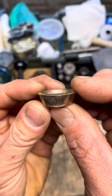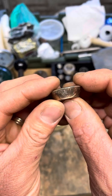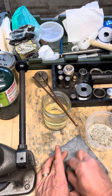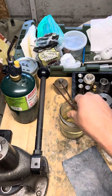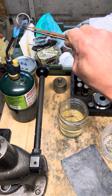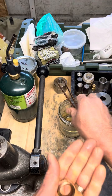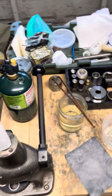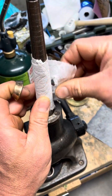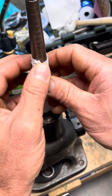Let's take a look and see what we got — nice and straight edges. We can go ahead and sand the inside edge, anneal, and just start opening up on the ring stretcher. We're going to a size 16, and this only goes to a size 14, at least on mine.